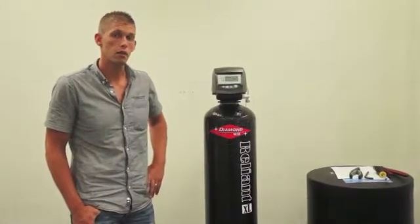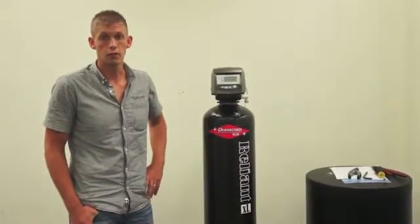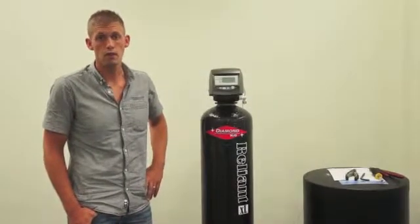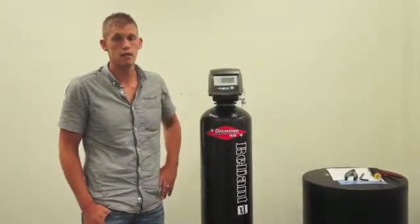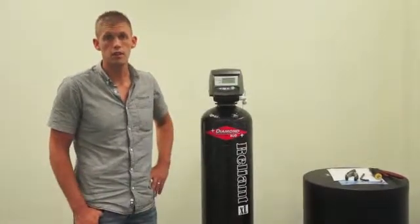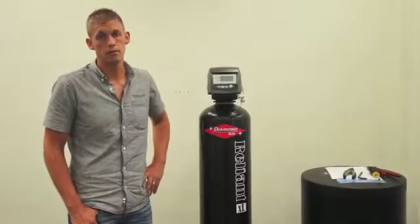Today we're going to be talking about the Reliant XL and the FE iron filter. We're going to be tearing apart the valve, and I'll be going through how to depressurize the system, bypass the system, and remove the motor, the discs, seals, our screen, and injector.